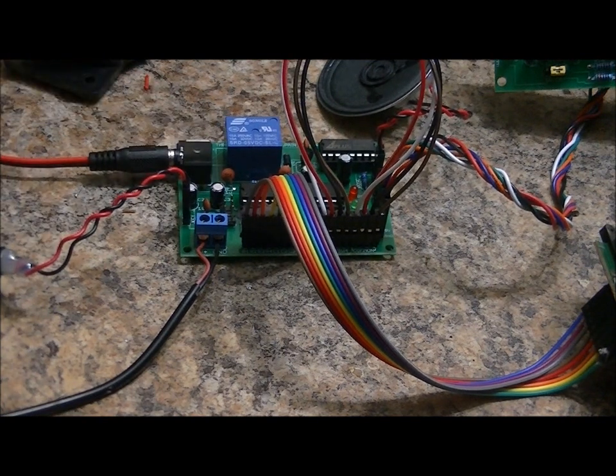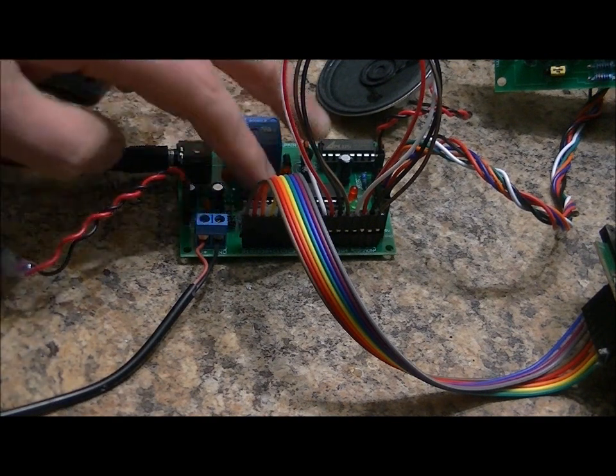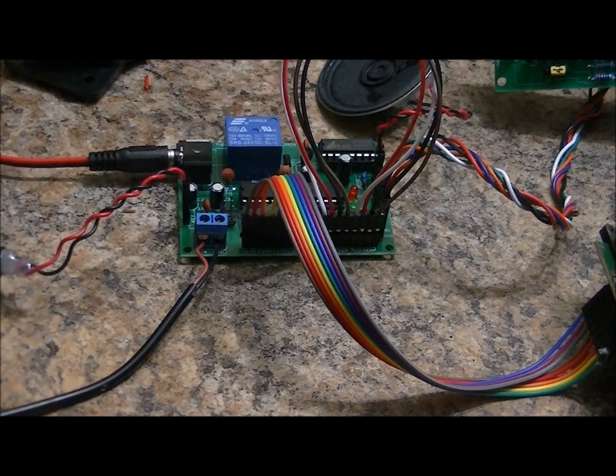It's not a difficult fix, it's not an expensive fix, but it's going to require fixing because at the very least you're going to blow this 5-volt regulator, which takes 9 volts and transfers it down to 5 volts, which safely powers the electronics. So keep that in mind. If you reverse that and you power up, it's going to go poof. You're going to blow this capacitor and you're going to kill that regulator. So that's one of the most important steps, but it's going to come connected.